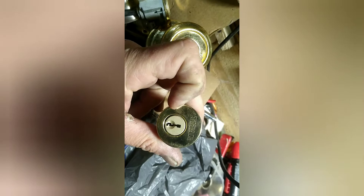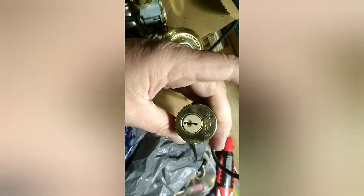I did get a handful of these Titans, which are supposed to be a higher-security Kwikset version — they're not, really. It's a different key, I think it's a K10 instead of K1. They're a little taller and longer, six-pin not five. They're interchangeable core — you push that in and it pops out. It's supposed to be higher security, but to pick one is just as easy as any other Kwikset.